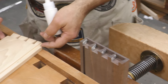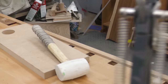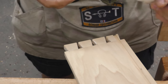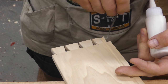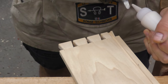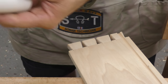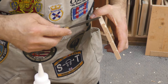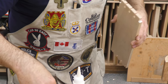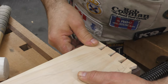None on that back wall because it's an end grain tail that's going to go against it. Out here, now you may also want to have some clamps handy in case you have to pull something together. I prefer it such that friction alone will hold the joint together. Clamps sometimes introduce pressure that may throw things out of square, but sometimes you need it. Now I do put a little bit of glue on those outside surface, along end grain surfaces. Don't know why, I just do it. Set this in place first by hand so that you're not forcing it somewhere where it's not meant to go.